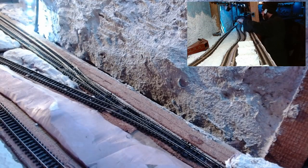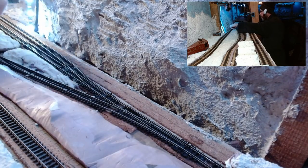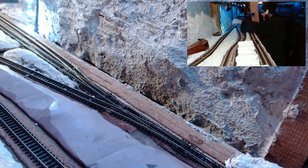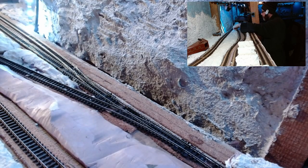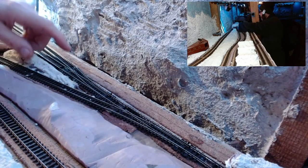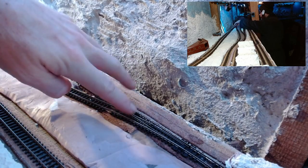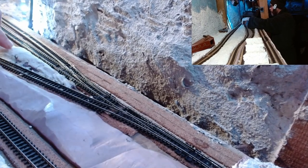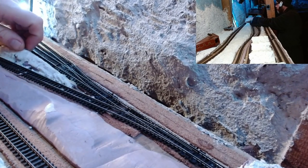All right, so what happened before is I had sparks coming up right here. I told you that when my locos were backing up into line one, they would come out. Sometimes it caused a short. But when the locos were backing up, it always caused a short. When the cars were backing through with metal wheels, they were causing a spark. All right. So I pulled these two turnouts and learned that both of them are Electrofrogs from PECO. And so we know how to set up the non-metal conducting rail joiners as a result.